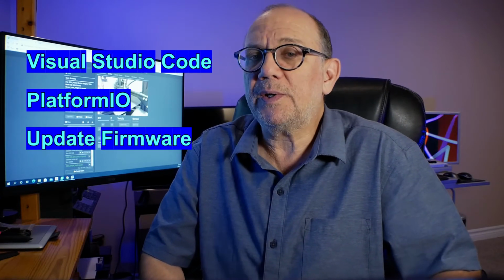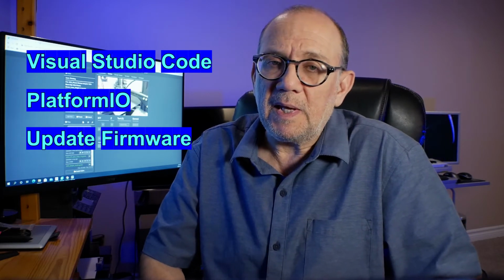So, as I mentioned earlier, in my case, I replaced the 8-bit motherboard on my Ender 3 with the SKR Mini E3 version 2, which allows for easy updates of the firmware. Now, if you haven't done this yet, and you've got an Ender 3 or an Ender 3 Pro, I highly recommend investing in this board, as it'll essentially take your printer to the next level with a 32-bit board. And as a bonus, it'll also make your printer almost completely silent, given that it's got silent stepper drivers built in.